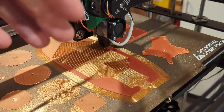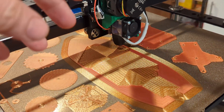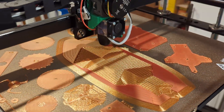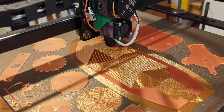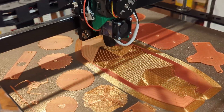Even though the nozzle could have moved up three millimeters if there was room, just the weight of the thing itself was enough to stop it. So that right there proves there's no reason to have more force if the nozzle can't even push out plastic beyond what the current force level allows. Any more questions, feel free to ask.